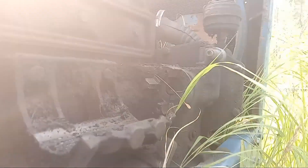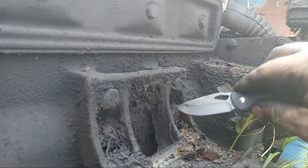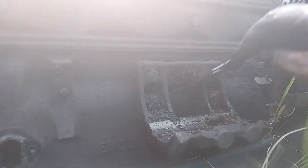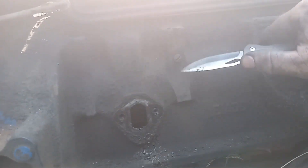With the injection pump removed, we've got this little thing here. I'm going to clean the dirt out of it - it bolts with four bolts onto the side of the block. This tells you the tractor was older than 1962 if these four bolts are in the block. This bracket is different, and there are two extra holes in the block drilled on the newer blocks and on the industrial blocks when they had the mechanical governor pump, which had a longer shaft.